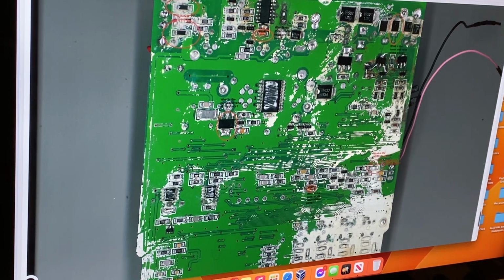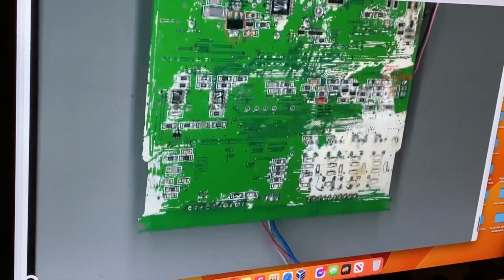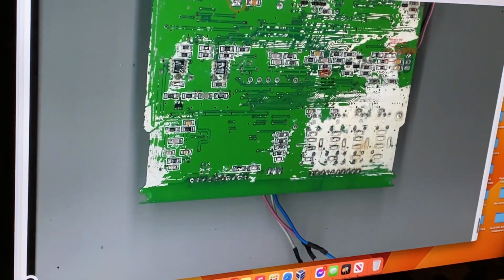But all the components on the other side of the board here have their rail from these two components here. I can't remember which ones. One delivers a filtered +5 and a -5, and for memory, NTM54N01 or something of that nature. They're just MOSFETs. They're just SOIC packaged P and N channel MOSFETs.